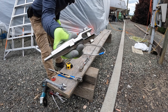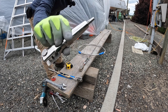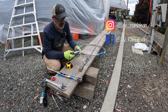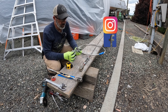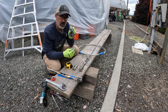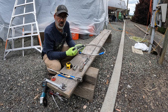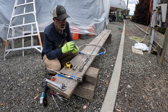Hayn high-mod fittings — if you haven't seen these installed, we did all of our standing rigging; you can go back and check out that video. They're just compression fittings, like a Staloc or a Norseman fitting. I like the high-mods because you don't use sealant and they're serviceable and inspectable. It's got a wire cone that forms over the outer strands with the core strands coming through the middle. It's a 1x19 wire — pretty simple. You just put Loctite on the threads and slap it together.